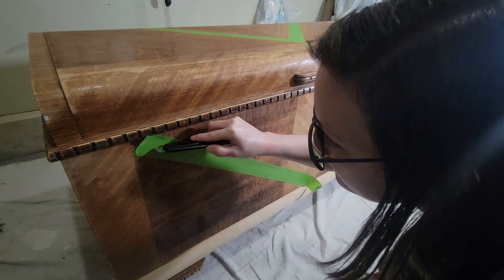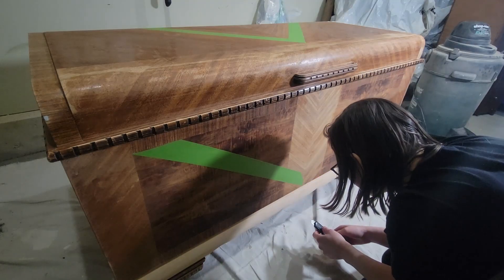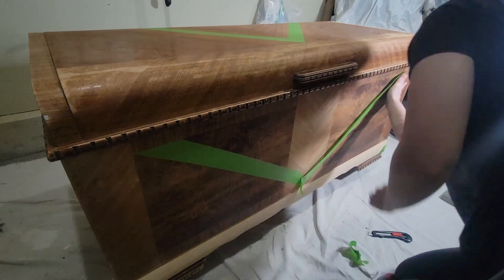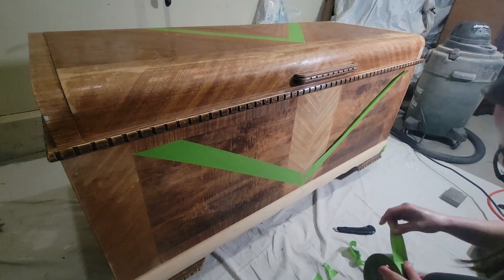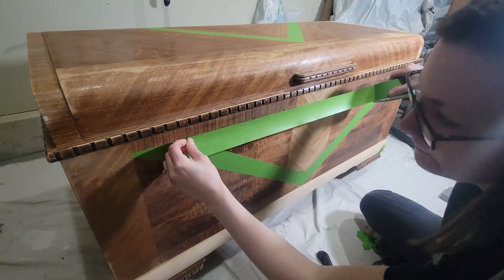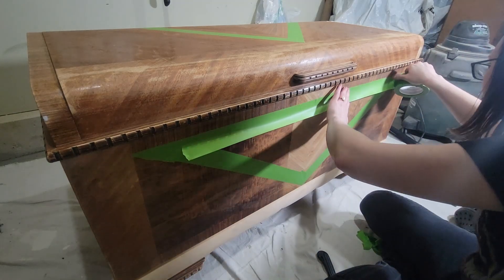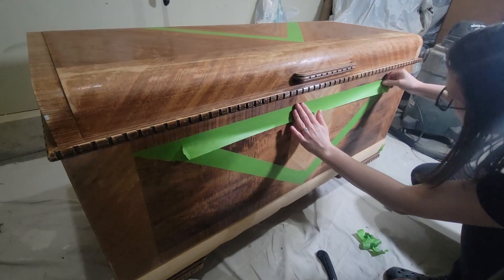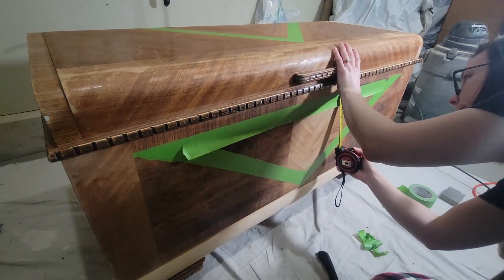For the front of this piece I'm going along the edge of the square and just under where I had to put the Bondo, because the Bondo is not stainable. It took me quite a while to get this how I wanted it, and I really should have covered the triangle with tape because when I was priming I ended up getting paint on it — which was annoying and meant I had to sand it again. So just know: cover it to save yourself that step.